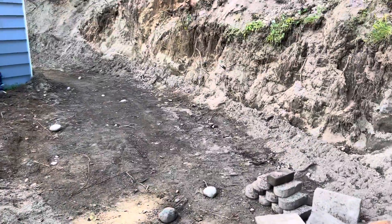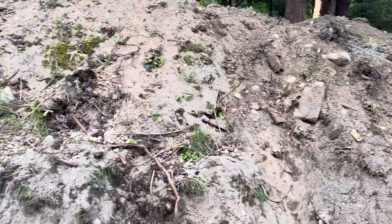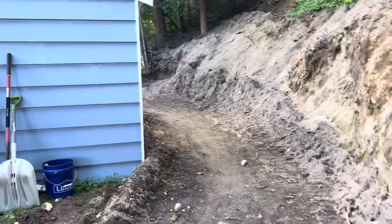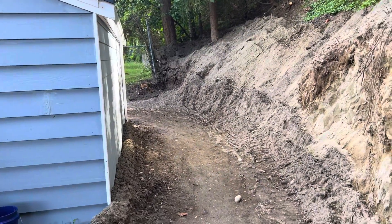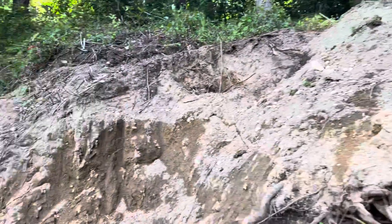So you can see it's curved around here. We've put a lot of dirt up here on the top of the hillside that we'll be later bringing for backfill and grading out the terrain. And we've made access here — this was real tight coming up along the house, about three and a half feet. We were able to get an excavator around by clearing out a lot of this hillside and then put as much dirt as we can up there.